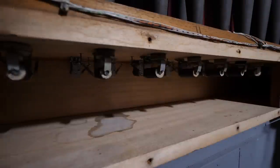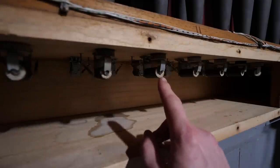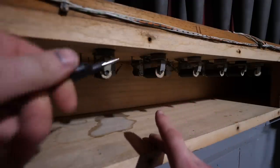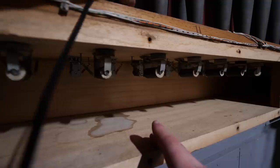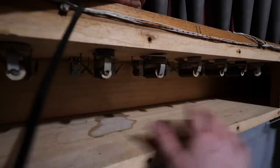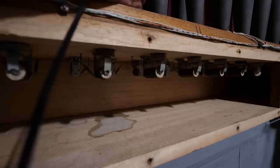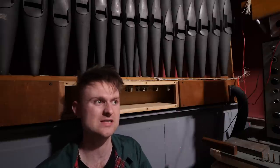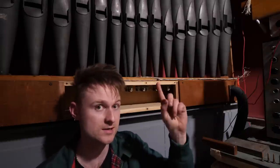It actually works. So inside of Stanley, you will see these valve solenoid thingamajiggies. They're right here. And I figured I should just quickly show you what they actually look like when you put a bit of voltage through them. So you charge up the coils and it basically just pulls down the little stopper and lets the air that's inside here out through the pipe, which is up here. Look at that. It's as easy as that. And then you want that one to go, you just put electricity through that one. So now it sort of makes noise. It doesn't really make a musical noise, but it makes a noise.